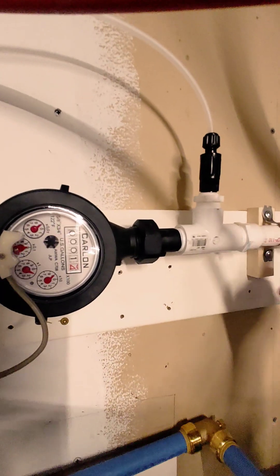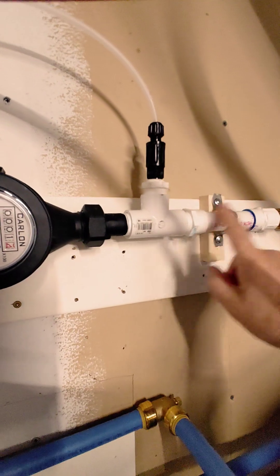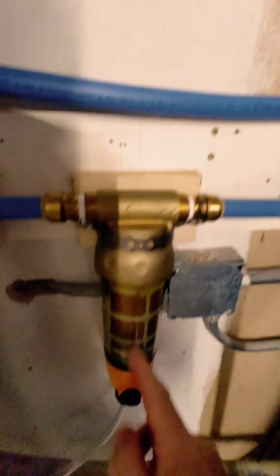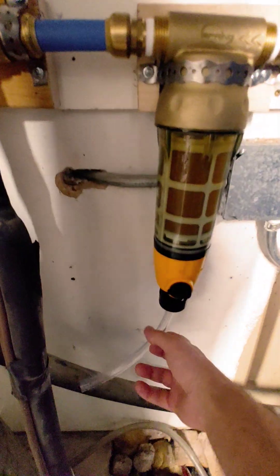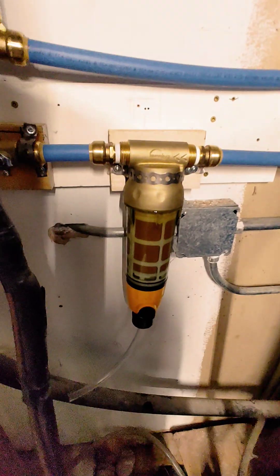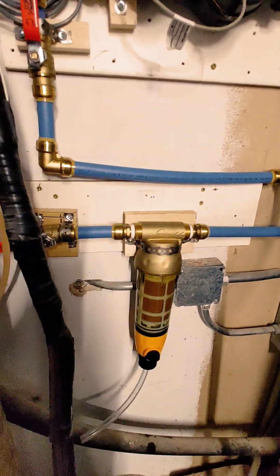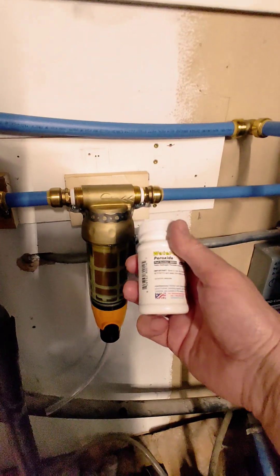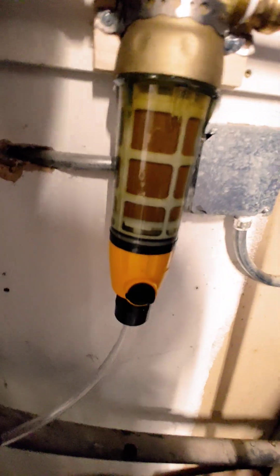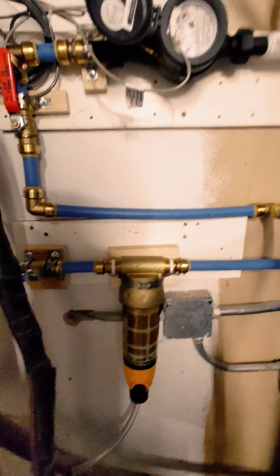It gets pumped into here — I had to make this little reaction chamber, and I made sure there weren't any metal parts in it. It goes through to a spin-down filter, which gives me access here so I can see what it's doing. I did the calculation bringing everything back to litres and moles, but in the end you just use these peroxide test strips and I've got a residual five parts per million going into the rest of the water system.